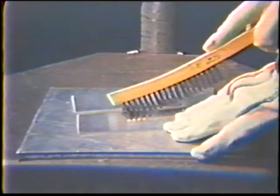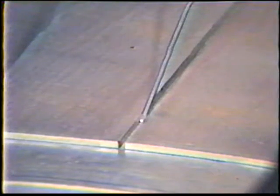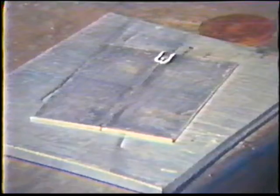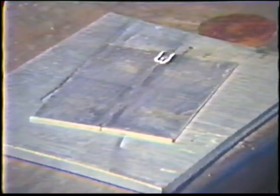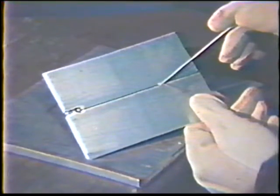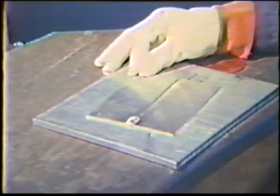To form the workpiece for this job practice, thoroughly clean two pieces of aluminum to remove the surface oxides. Pay special attention to cleaning the joint edges that are to be welded. Using a three-thirty-seconds-inch filler rod, space the plates for a three-thirty-seconds-inch root opening. Remove the spacer and make a one-half to three-quarter-inch tack weld at one end using filler metal. Realign the joint to compensate for tack shrinkage. Then position the workpiece for flat position welding with the tack welded end to the left if you are right-handed.